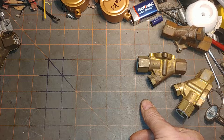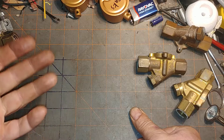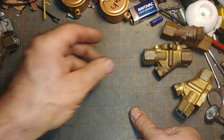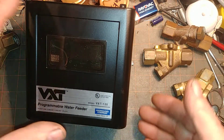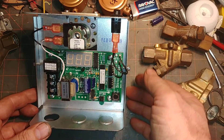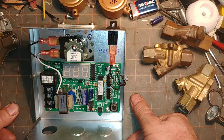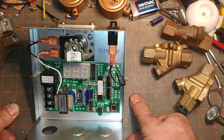Let's say you're absolutely certain that the boiler flooded because you've got water squirting out of vents and relief valves and so forth. So you focus on your feeder. We have the VXT here — this particular model happens to be the 120-volt unit. You come down and you see that either you hear the valve passing water, and you go to your shutoff. You want to make sure your shutoff works and you know where it is.